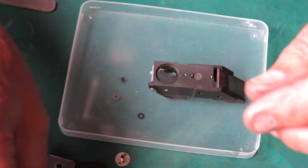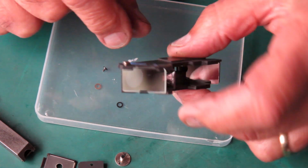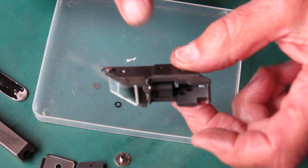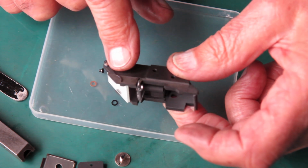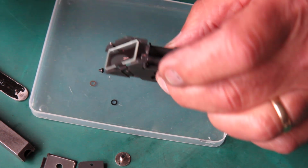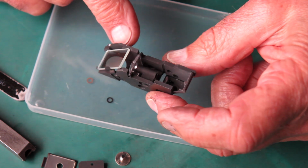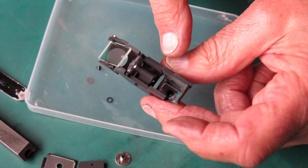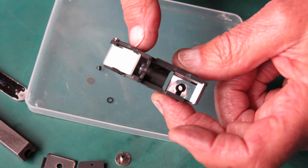Okay, so here I've got my rangefinder stripped down as far as I need to take it. Basically, I've only got those two components in there and this plastic condenser business in here. That I'll clean in the ultrasonic cleaner, and what I do is I put that in a little glass with some hot water and a drop of normal domestic dish soap, and then suspend the glass in the ultrasonic cleaner. Usually I'll give it 3 minutes, pull it out, rinse it under the hot tap, blow away all the water, dry it with a hair dryer, being careful to use the blower at the same time so you don't end up with any droplets drying on a surface. Keep blowing away any droplets that you see, otherwise you end up with coffee rings. And then check it.